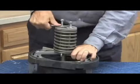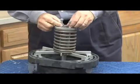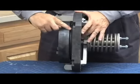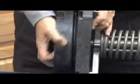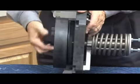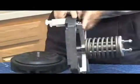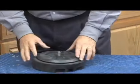That's a little bit of time lapse photography because I've tightened that all the way down. Approximately 10 to 12 half turns. And once I've taken it down that far, make sure your lock nuts stay here. That keeps the security of that all thread on there. But what you should see now is you should see a gap between the disc holder and the seat. What that allows to do now is that this disc holder can actually be unscrewed off the back of the check stem. Now it will be a little tighter than that. I had this loosened up for demonstration reasons. You may have to put that onto a vise to get that loose. I'll show you how that check mechanism works. So there the spring is in a controlled fashion right now. There's my check seat. I'll put that on the side for now. And I have my disc holder now.